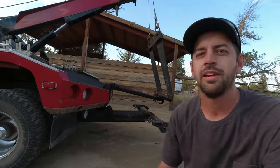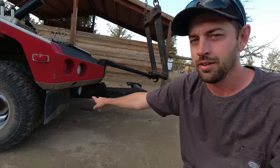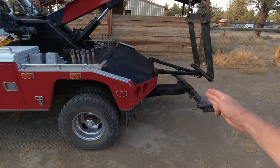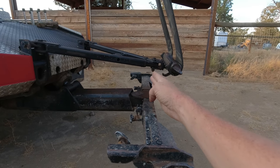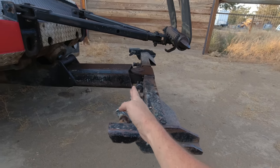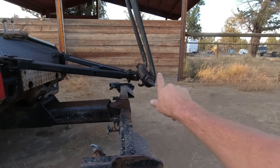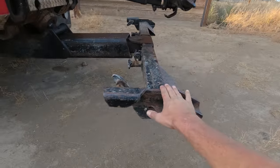But what no one has taken into account is that that pry bar is a hell of a lot bigger than that pry bar. All that matters when it comes to weight distribution is how far from the rear axle the load is placed. With the sling in its most collapsed position, it is actually slightly farther out than the wheel lift is — and I even have the wheel lift out a little bit so it can still turn when you suck it all the way in. Either way, the sling actually has a farther-out pick point than the wheel lift does.